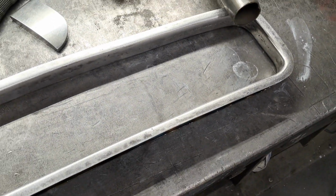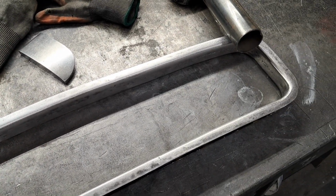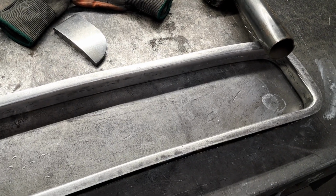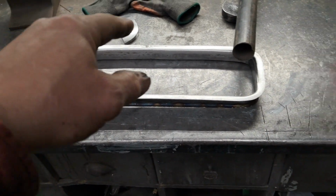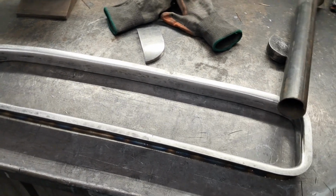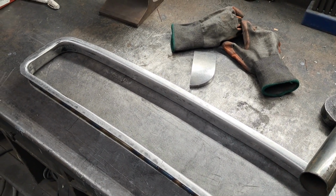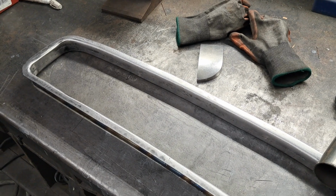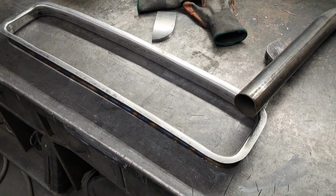There's just a small amount. If I set that on the corner, it just barely touches it. So there's no pressure at all as far as putting it in. Took a while. It dimensions out. The gap dimensions out perfectly all the way around within a 32nd of an inch. No lie. So now I'll just dress it with a skim coat and sand it. Again, this gets covered in a wood grain. So very happy with it, and it took a while to trim.